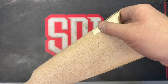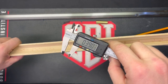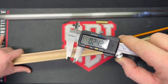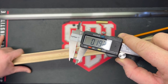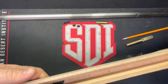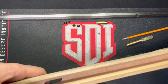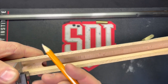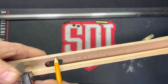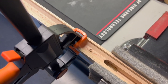That brass is nowhere near finished-polished yet, so I'll do that in the next class. Here we're installing the front thimble. I used my calipers to find the center of the bottom flat of the barrel channel — because it's an octagonal barrel, that made it easy to find the center to lay out where to drill the hole for the thimble. I didn't need to do much shaping or inletting; I did clean the thimble up and it just more or less dropped into place. I laughed to myself a few times taking measurements down to the thousandth of an inch and then marking with a pencil that's ten thousandths thick — but that's the reloader in me.